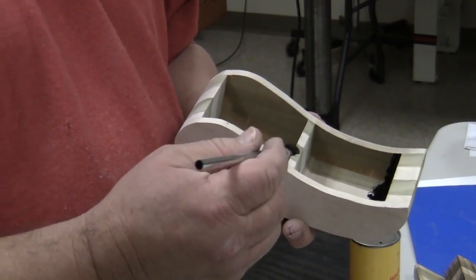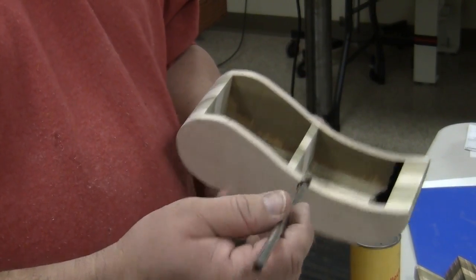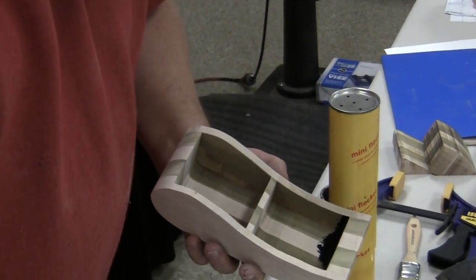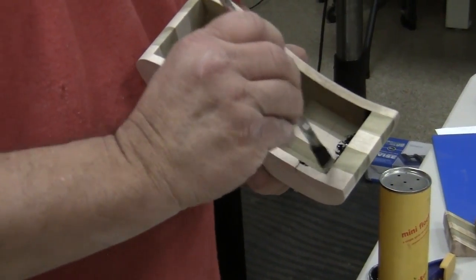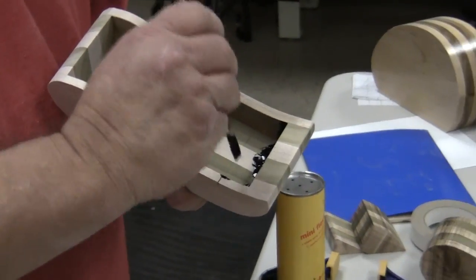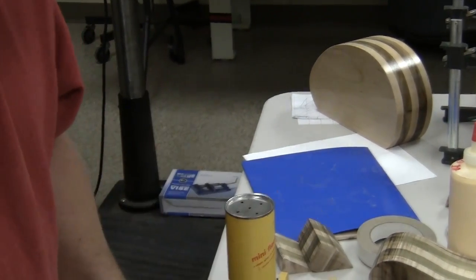And I've never found any problem with any type of wood of just putting the adhesive on that I would need shellac on there. You know, shellac you use for a lot of things because most paint and stuff will stick to it. But I have not found a reason why I needed to do that. So I'm not overly careful. I try to get it somewhat straight. If you get anything on the top here, just wipe it off when you're done.